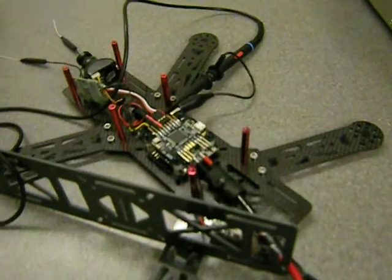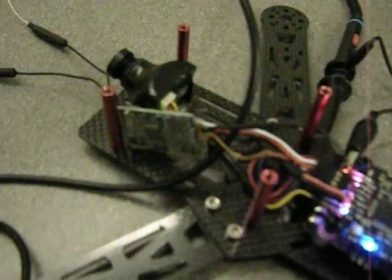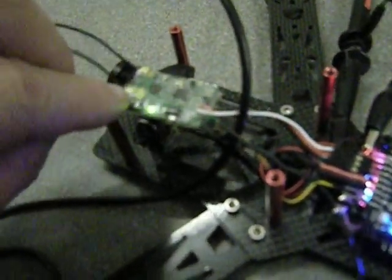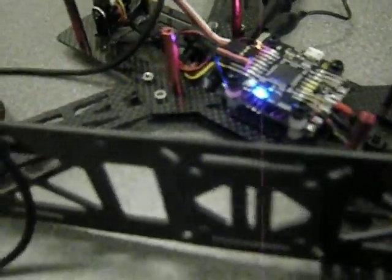Some people say that you need to turn on the transmitter first, and then turn on your quad, and then you should get a reading. I still don't get a reading — there's no RSSI. This receiver is running EU listen before talk, EU LBT firmware, which is the one that FrSky recommend. Everything is wired as it should be, but I don't get an RSSI value.